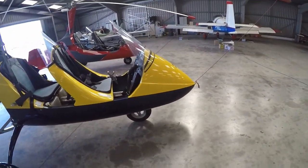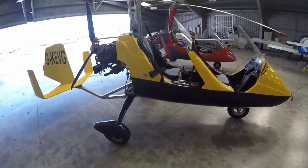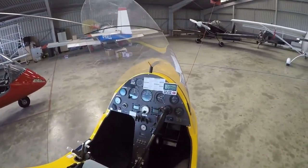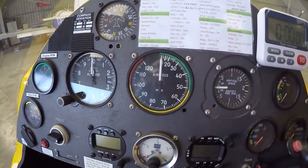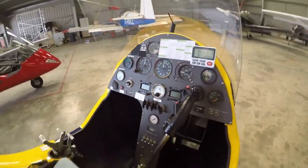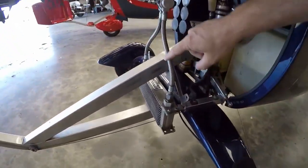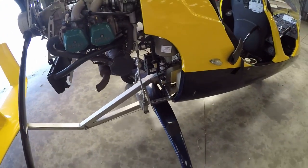Bear in mind that originally a lot of these were bought as instructor aircraft, and when they were in the 450-kilo configuration they were often flown overweight, which caused many of the snags to become apparent sooner. The airspeed indicator is topped out at 100 mph, but in truth they're more comfortable around 70–80 mph; up at 100, near VNE, they're really maxed out and vibration levels are pretty horrendous. The oil cooler pipes — this one has the optional upgraded braided hose, but the originals were rubber with swaged ends and they leaked terribly.